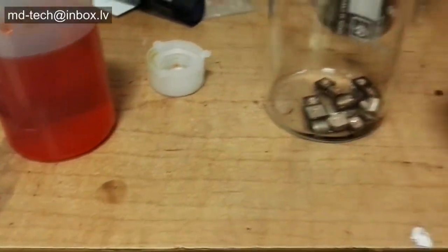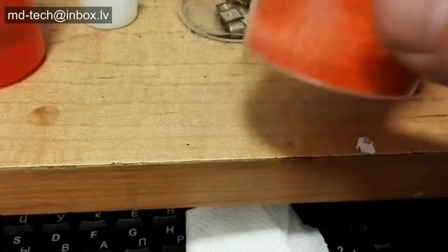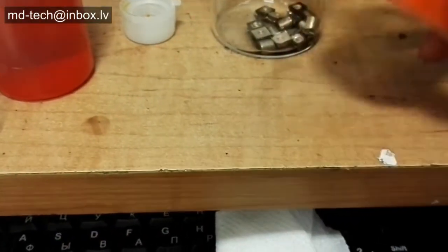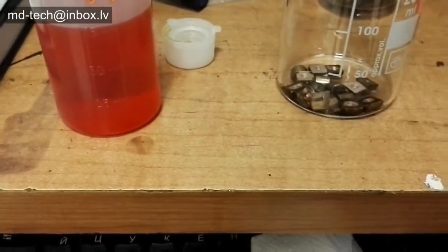I put the clean silver contacts in a beaker. I use battery acid and potassium dichromate. This solution is very corrosive — not to be touched by hands. Also, all chromium salts are carcinogenic. No fumes and no exothermic reaction follow. Silver is very quickly removed and the liquid turns dark brown.